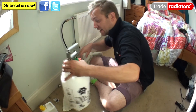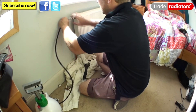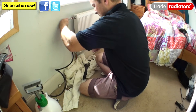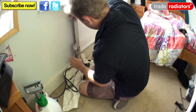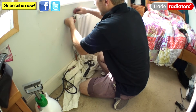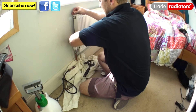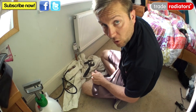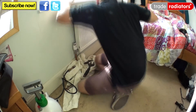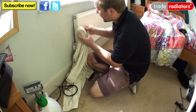So what we do is get ready with our bung and pop that back in there. Then we shut this valve here, open this valve here, and open our lock shield at the other end. Now all we need to do is vent this radiator of the air that we had at the top of it.